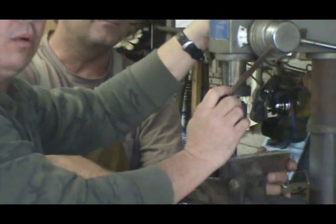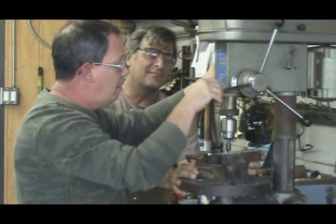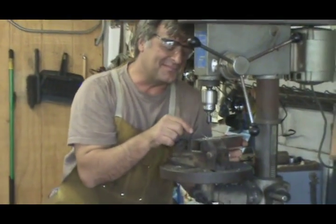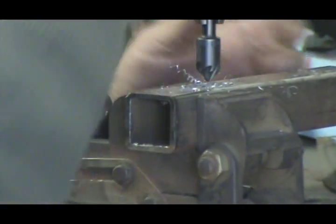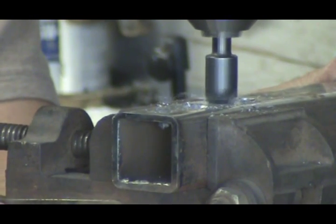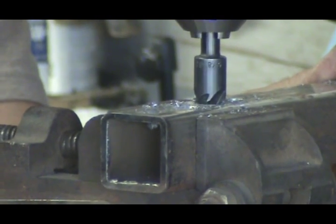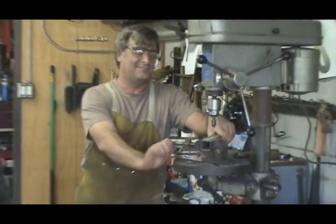When you stop it abruptly and don't let it drift and keep too much pressure on it, you still leave a chip in it — that's not what we want to do. But to help Kevin's endeavor out here, you can hear it squeaking and hollering. Put pressure on it and drift until we get the perfect countersunk hole. And there you go.